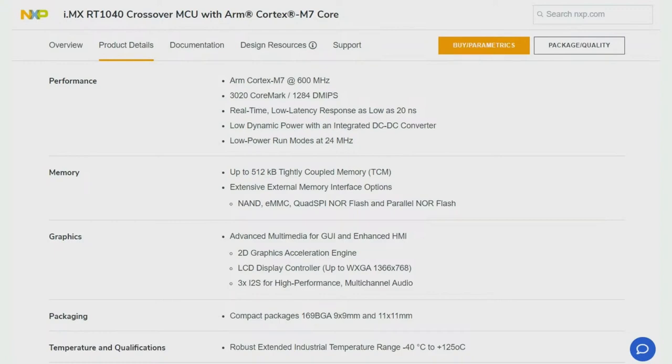You can also use parallel NOR flash, eMMC, or NAND. QSPI is the cheapest and easiest — it uses the fewest pins. But instructions for the firmware running on the chip are bound by how fast you can read from that QSPI NOR flash. So by dedicating maybe 128K of tightly coupled memory, you can cache instructions. If you're running in a large enough loop, you can cache the whole thing in tightly coupled memory and get the full benefit of that 600 MHz processor, without being slowed down by your flash memory, which might be 100 MHz at most.